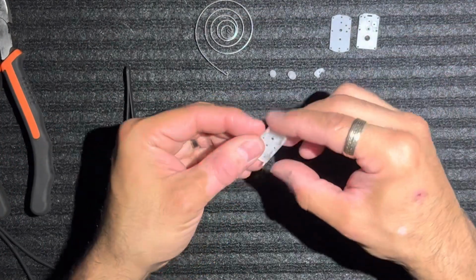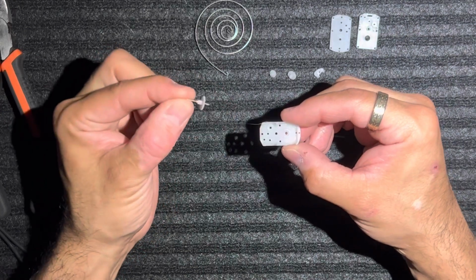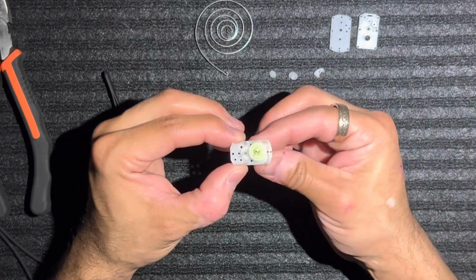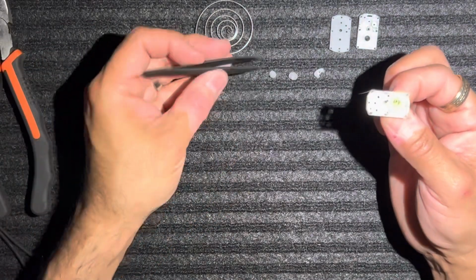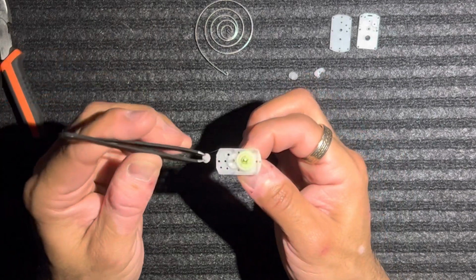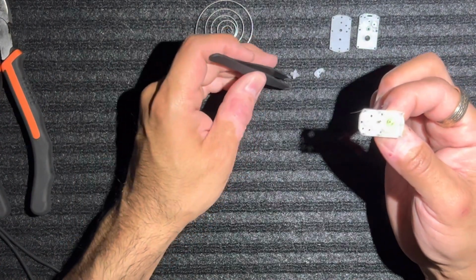After checking everything out, it's time we start the reassembly of this gearbox. We can begin by placing in gear 2, which fits in the middle of the gearbox. Main gear and S-spring gear follow. And we'll go ahead and put gear 1, or the spur gear, that goes above gear 2. Gear 3 will follow beside it.